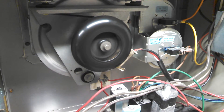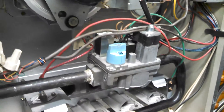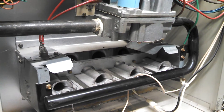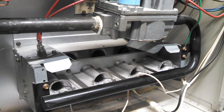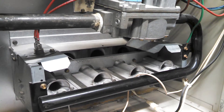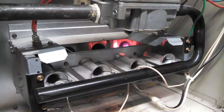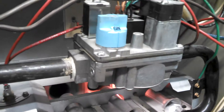Just called for heat. The inducer fan starts at 15 or 20 seconds. It warms up the flat plate igniter. Here it's coming on at 25, probably at 30. The gas valve will click on.